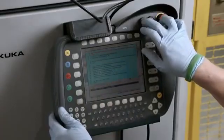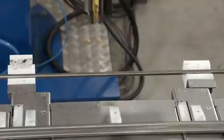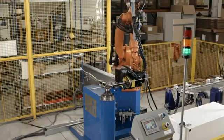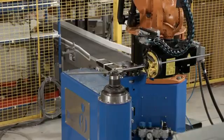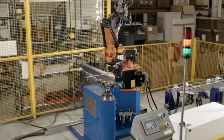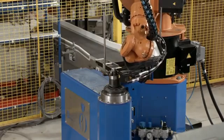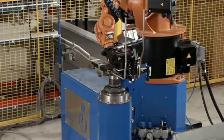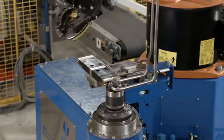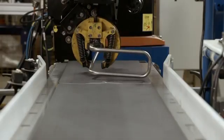A worker programs a robotic bender to bend the cut tube to the required shape. These bends are so complex that no traditional manually operated bending machine would be able to do them this accurately. The heater sits right inside the DEF holding tank. That's why manufacturers use stainless steel rather than ordinary steel for this tubing. Stainless steel better resists the corrosiveness of the DEF fluid.